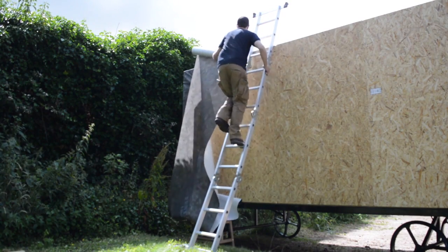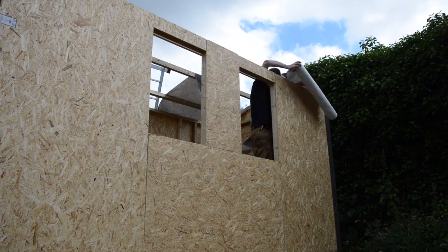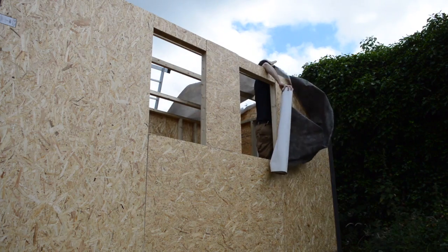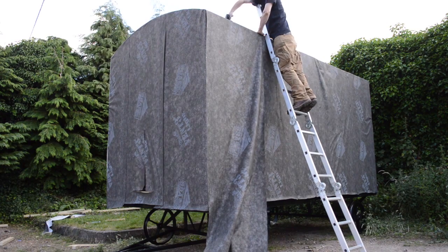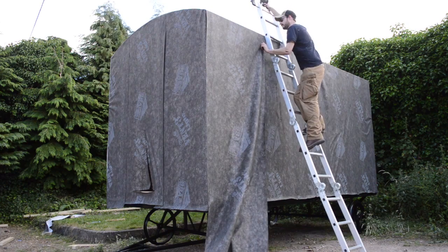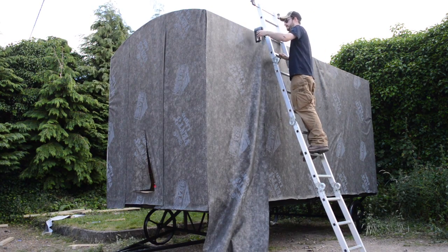I just got a one meter wide roll, but for larger projects you can get it up to two meters. Passing the roll over the hut — another pair of hands would have been easy — but I managed to get it up on the roof, then get down the ladder into the hut and throw it over the other side. I could then pull it all tight and staple it down, just repeating the process working my way down the hut overlapping each seam. Next is to get it taped up and the roof on. Thanks for watching, please subscribe for more videos.